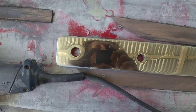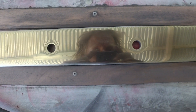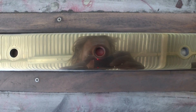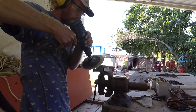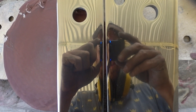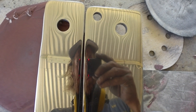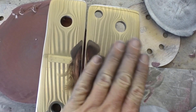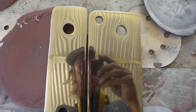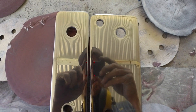We are at 120 now and it's starting to look very good. I've gone through all the papers up to 3000 — this is 3000 here, but it needs to be a little bit better, so let's go on with 5000. After 5000 sandpaper it's not perfect but I would say it's about 90% good. Still some very small scratches — not super easy to see them when they're installed anyway. Maybe I'll polish a little bit more.